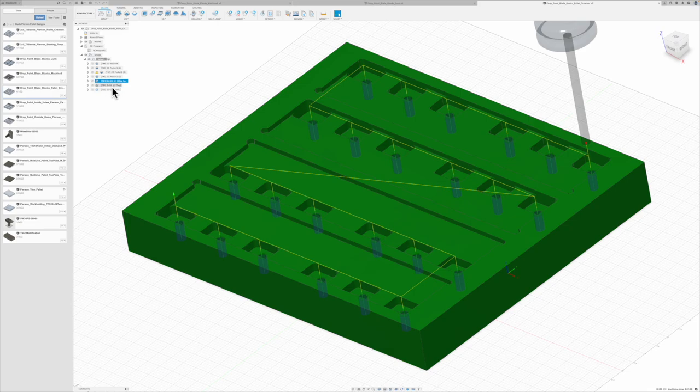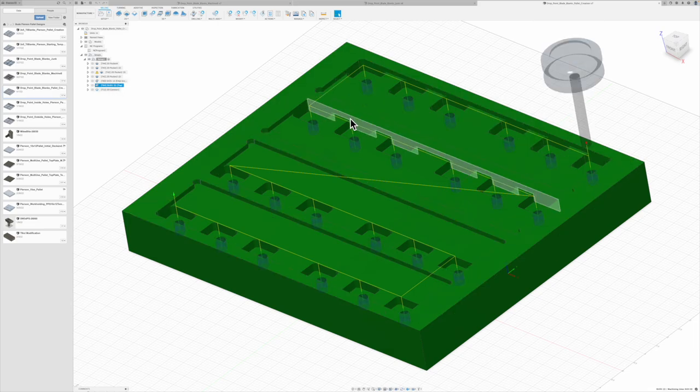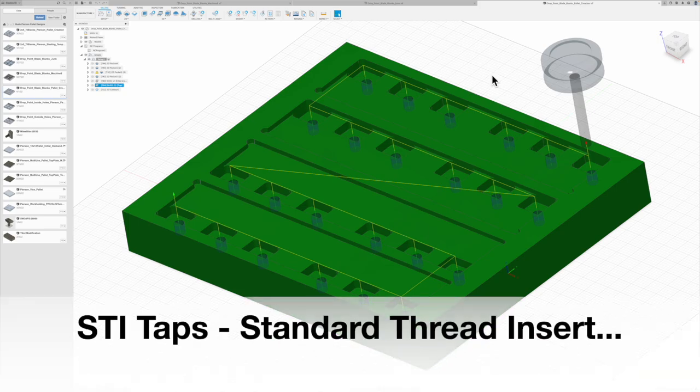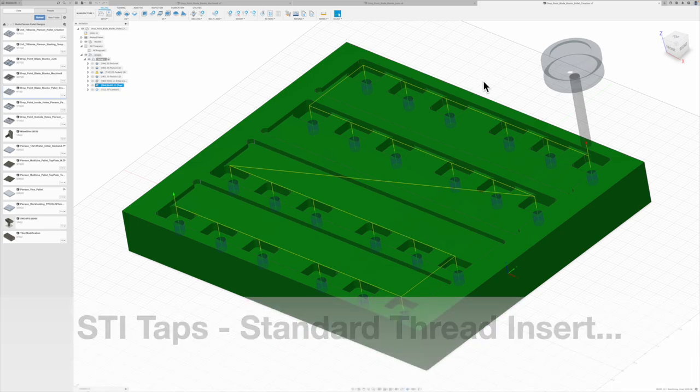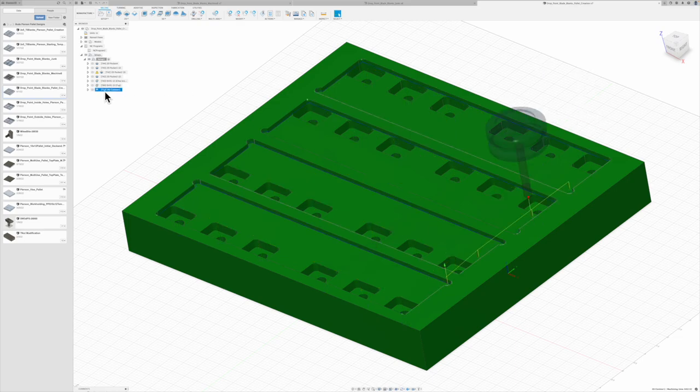After that, we're gonna drill it out, tap it. I've ground off the tap since last week since I used it for hand tapping into the bottom of these holes, and I also set it for 50 thou deeper. So we should tap considerably more threads in here using the machine and have a lot less to go hand tap after. And ideally, I should have a spiral point tap, and you can buy spiral point taps in this helicoil tap size. Just why do the extra costs? I'm not going to use it that often. If it was a production part making hundreds of them, I would definitely invest in a better tap to do that.